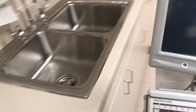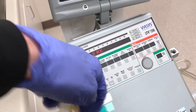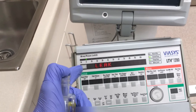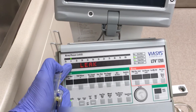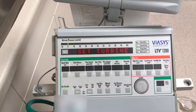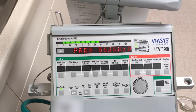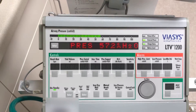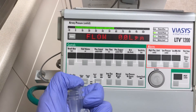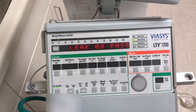Success! We will now grab the Y piece and plug it with our mighty thumb — or, if you can, use your palm if your thumb is not as mighty as mine. Press and hold it and push the select button to activate the leak test. You can see it's spinning up the turbine and will then create flow and pressure and measure how much is leaking through. There's our pressure. And there's our flow. Still holding. Do the whole thing. Leak test passed. Success!